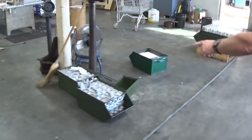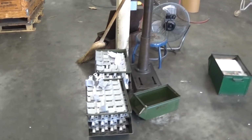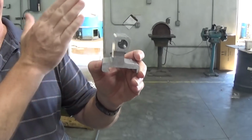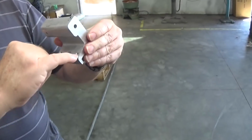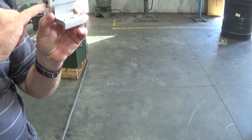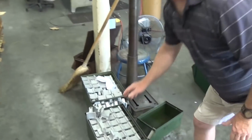There's more of the tailstock material that's been machined. That extruded material we saw earlier in the shipping department has been cut to size, and then this area is machined away. Various holes are drilled, bore drilled or tapped, and then this is bored on a special machine, not in one of our mills or lathes. Right. And then they come through here into the tumbling area.